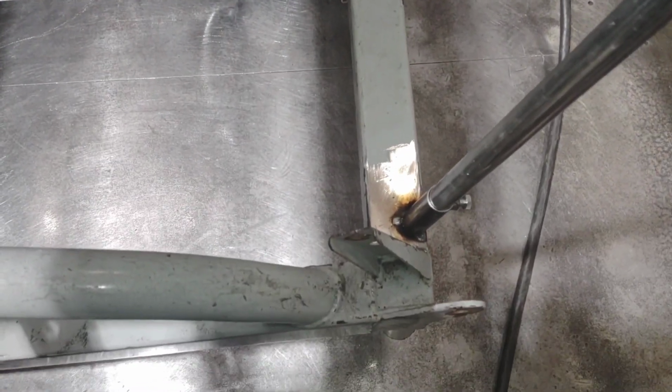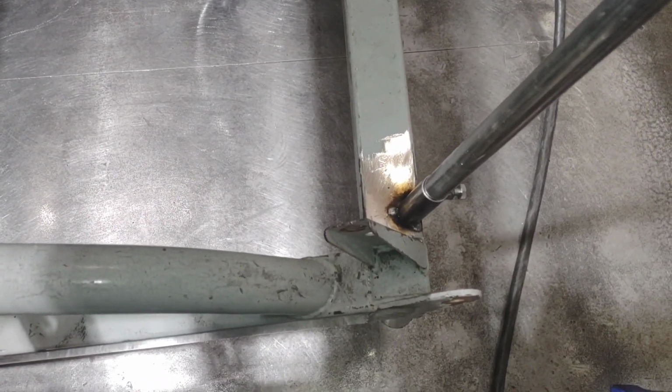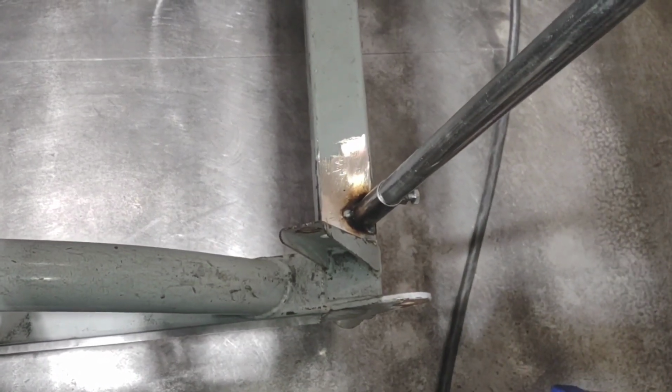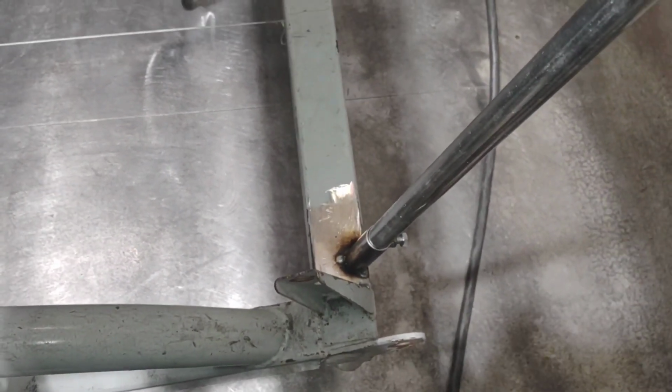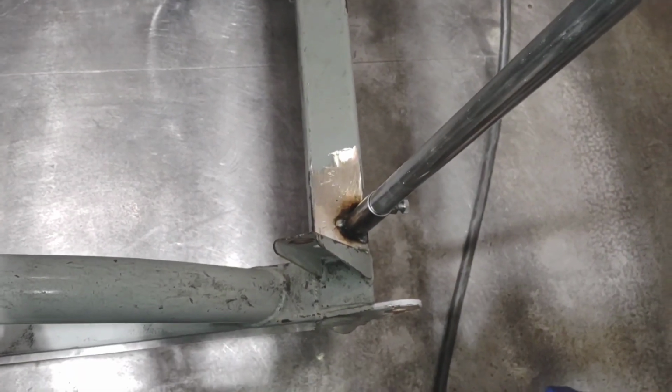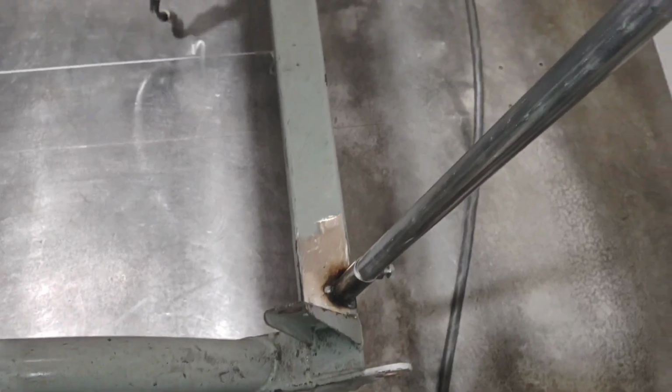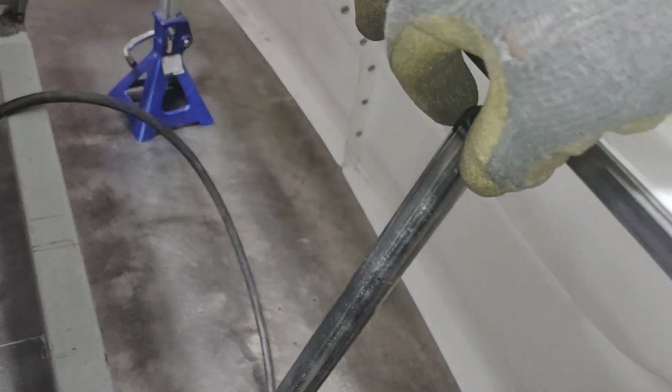I've now got the bottoms tacked on. I used 3 tacks, kind of do them in like a triangle pattern, 1 in the front and then 2 off the sides and the back. This way it supports it side to side and forward and back, so I know it's not going to move. I used my square to make sure that they were perfectly vertical so you don't have them running at wonky angles. Now I need to attach the top.